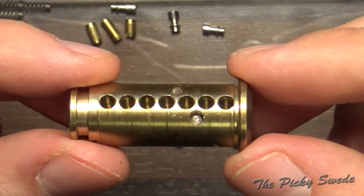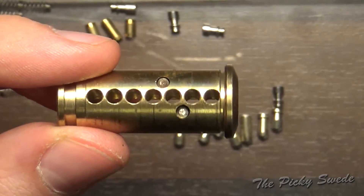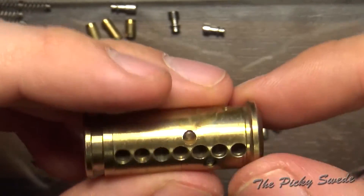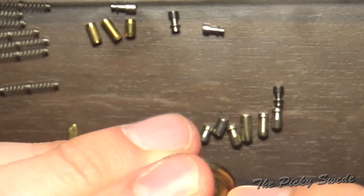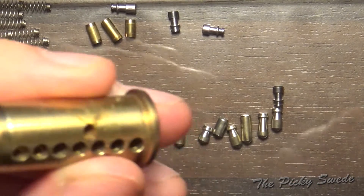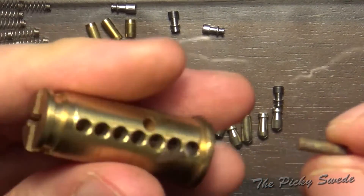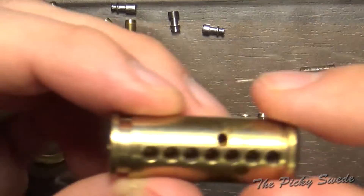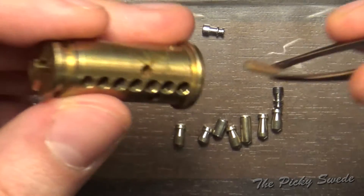We also have the core here, with anti-drilling inserts — two of them. And actually those carbide tips, you can take them out of this lock. At least one of them — and the second one also falls out. So the anti-drill inserts are also loose in this lock.